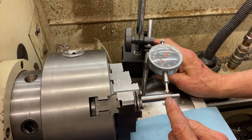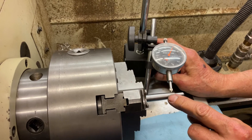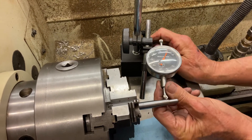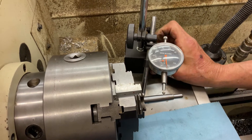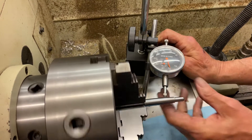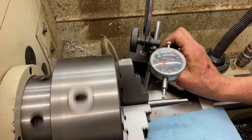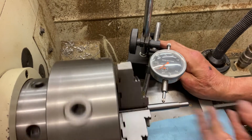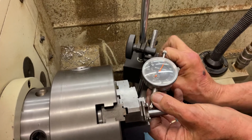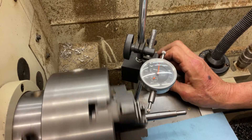Because what we're doing is we have to test all the way down, and we have this bend in here and a bend in here. So you just have to keep running it. A lot straighter in there. Then when you get right to the start of the taper, got about 10 thousandths in that. Then we get back down in here — this is the critical thing. I still got less than 20 thousandths in that.